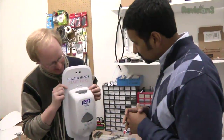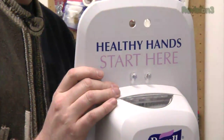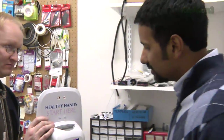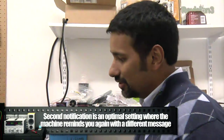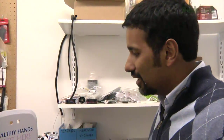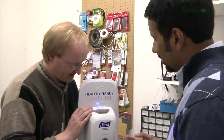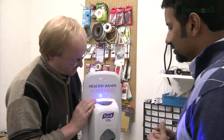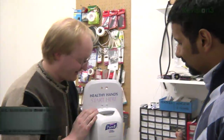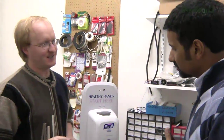Aaron wanted to add some LEDs to show status. He felt that if we ever considered a purely visual reminder — say, turning the auditory reminder off when patients are sleeping — we'd want something that works at night that providers could use. Two colors: blink red while waiting, and then solid blue once someone's done it. We were going to use a giant green LED, but RadioShack didn't have any big green ones, so we went with video game colors. We'll get this wired up, add a header for the lights on the circuit board, and then add blinking light logic to the programming.